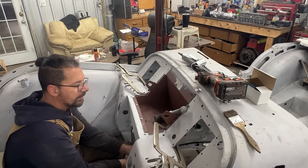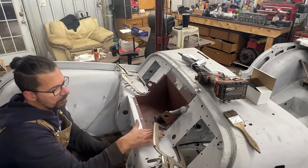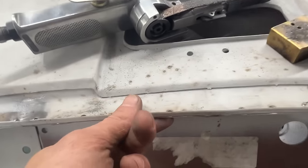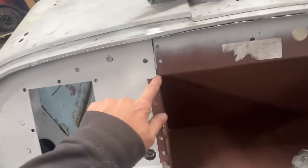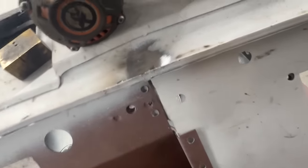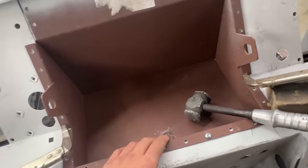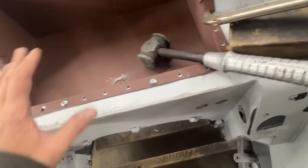Here I can push with a piece of wood from underneath and weld — so that's going to be fine, and that's how I'm going to go all the way. I just want to make sure it lays flat everywhere including there. It's pretty good. See, now it reaches all the way to the top — which is great. So now we just need to clamp it here and do all the plug welds. It's going to be a pain to grind them, but whatever. Here we're going to have to fill this gap. And here I think we're just going to weld it and fill it up — it's going to be stronger. This is right in the corner, so we can go to town with the welder now.